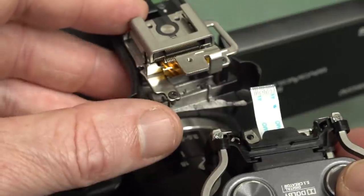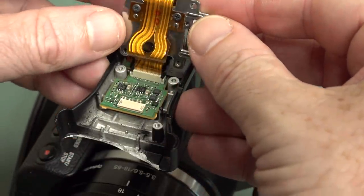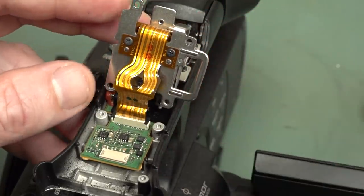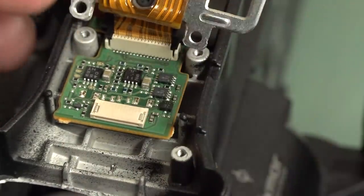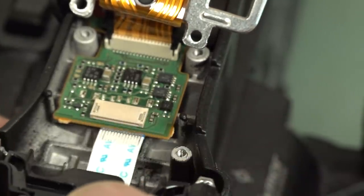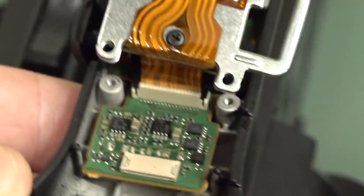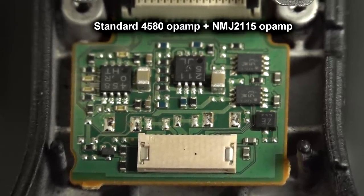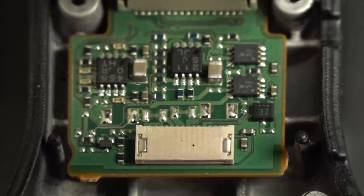Let's put it back together — this could be easy peasy. Get those screws off, fold back the hot shoe, and ta-da, that is our mic. That board still looks good — it doesn't have the little flippy bar to hold it in, so it looks like it just pulled out, just a friction fit back in there. Let's grab some long nose pliers; I should be able to force that back in there. They've got those weird SMD codes, but that's supposed to be like a five-channel driver thing, because this has one of those weird stereo surround head arrangements.